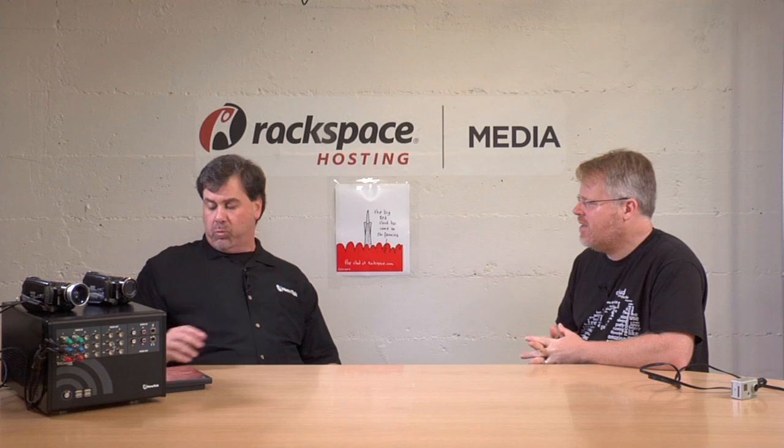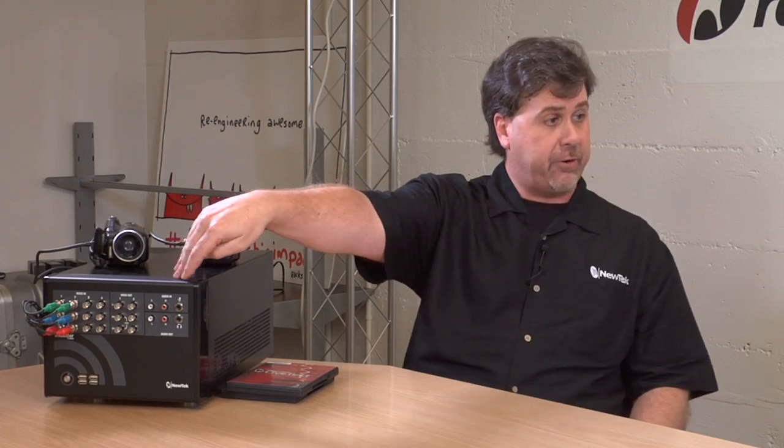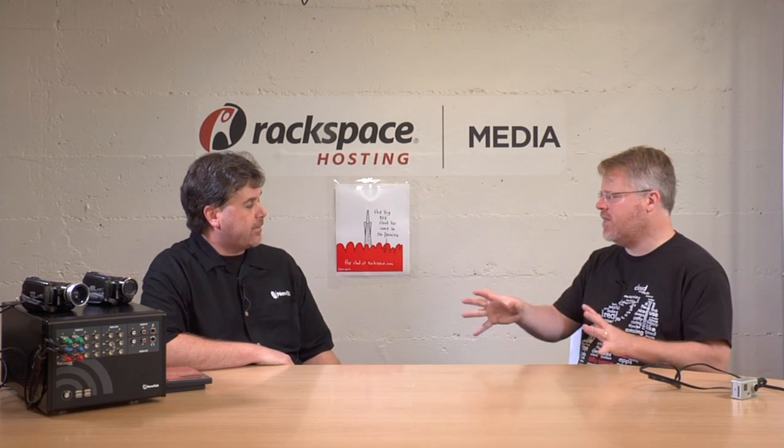What else do I need to know to make it sing? It hooks up in literally minutes — you just plug the cameras in, there's no gen-locking like in a traditional studio. You can mix one high def, one standard def, one composite, one component — TriCaster will up-convert or down-convert everything on the way out to whatever resolution you want. It runs from keyboard, mouse, and monitor, but there's an optional control surface with all the buttons for preview, program, camera switching, transitions, and overlays — putting full tactile control right at your fingertips.